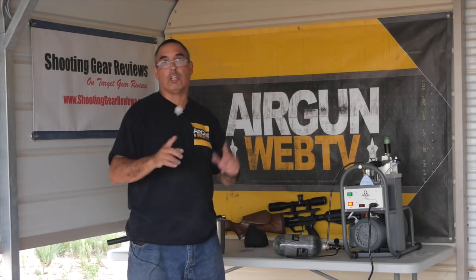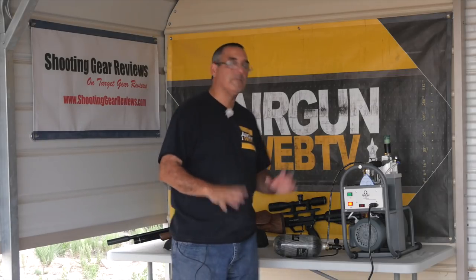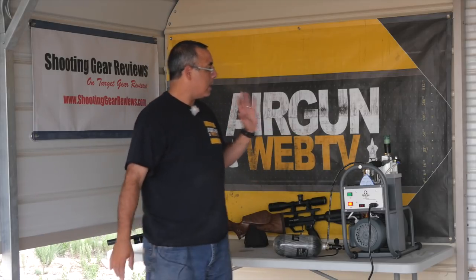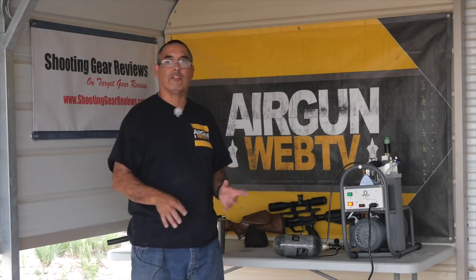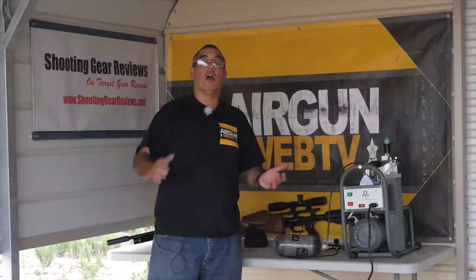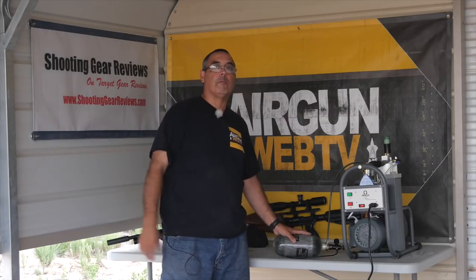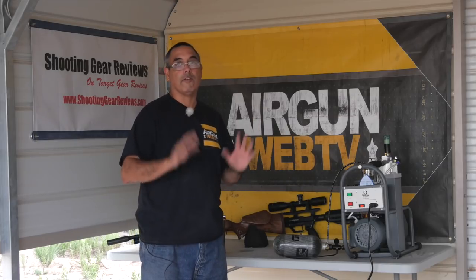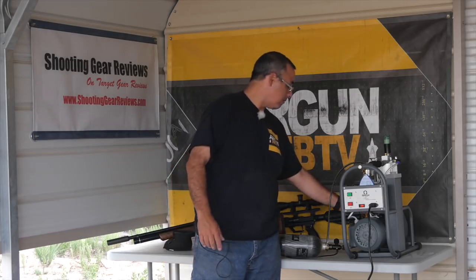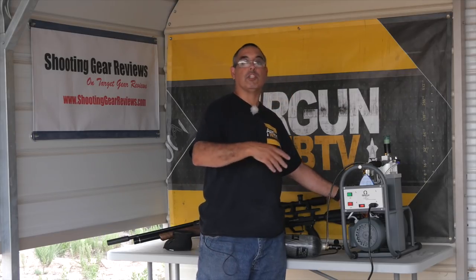The compressor just shut off and we are just shy of ten minutes. We're letting the water cycle run for about five minutes to cool down before shutting things down. The bottle is topped off — it took about nine minutes to get from 3,000 PSI up to 4,500 PSI. The system auto shut off exactly like it's supposed to. Now we'll go ahead and bleed this — that's going to let the moisture and all the crud go out.